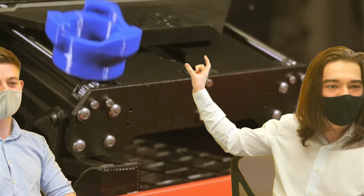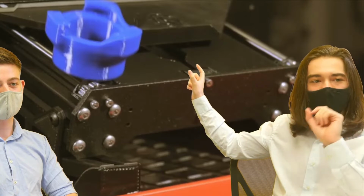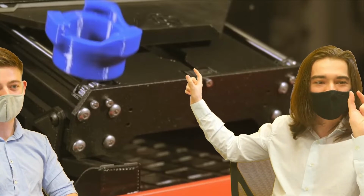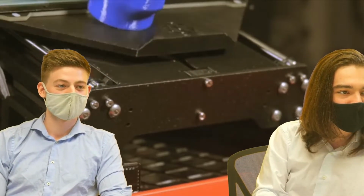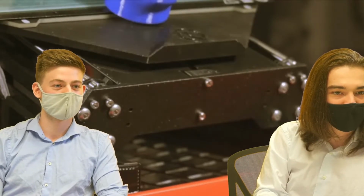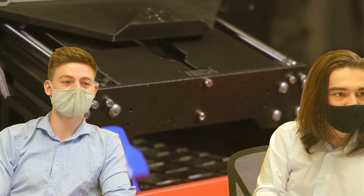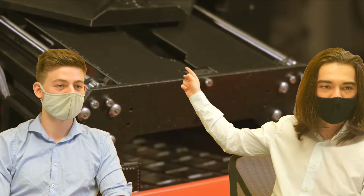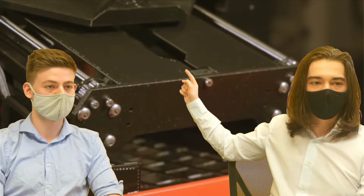And this hole is impossible to design out because that's where the linear bearing for the bed goes. And so there was a tiny chance parts would get stuck in there. That's why we added this front ramp, which you can see deflects any parts that are heading towards that hole. In this case, this part is probably big enough not to get caught, but it's pretty close to being small enough. You can see how the hole is pretty long. So thin parts without that front plow or buffer would just get sucked right in there, and then they would grind the belt and stuff. So we can't block that. It's the belt.